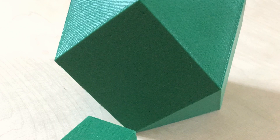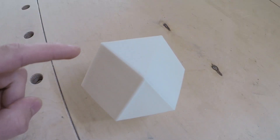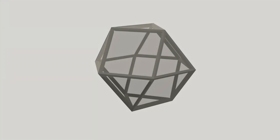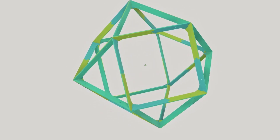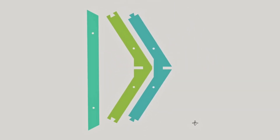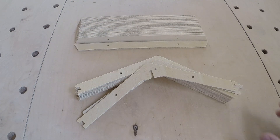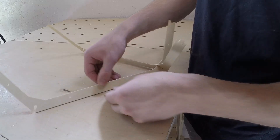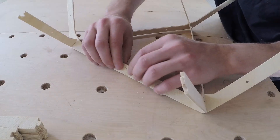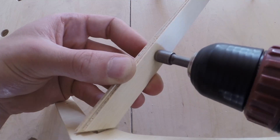We 3D printed two different size models and gave them to Ugyz for further inspection. It turned out the new shape performed better than the original one. So we had to find a way to make the frame for the shape using plywood. When designing complex projects, it's helpful to create smaller prototypes — it gives you a better understanding of shapes and proportions than looking at the object on the computer, and it gives you more confidence before committing to building the actual size object. This approach is commonly used among designers and architects.